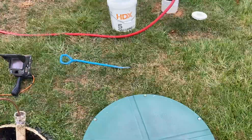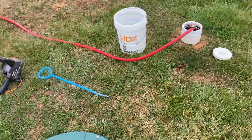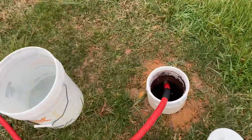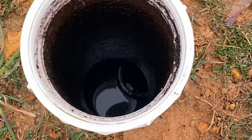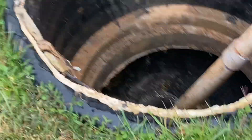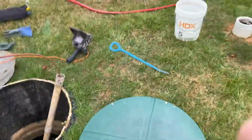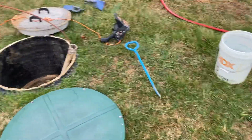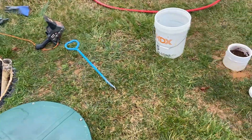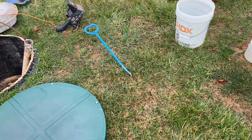In the middle of this tank is going to be a thing called a baffle. What that baffle does is it prevents any of the floating scum from reaching the second chamber. So if we look inside, we can see that the top of the water is far clearer in the second chamber than it is in the first. The wall baffles are good and in place. The goal of a two-chamber tank is to slow down the volume of debris working its way into the drain fields and should hopefully extend the life of your total system.